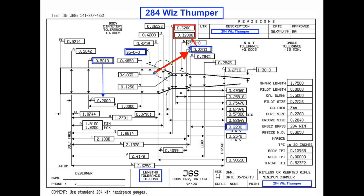Then we have the neck diameter. I'm only looking at this single number because I don't do any kind of tapered necks, as you heard Terry talk about. You'll see numbers here indicating different points across the neck. If the numbers change across those points, something's off. This is 320 to 320 to 320, which tells me this is a straight neck reamer cut. If for some reason it was 300, 290, or 350 or something weird, I'd want to know why I have an angle in my neck and that it's supposed to be there. With most common calibers — 6.5s, Creedmoors, 284s, Wisms — within normal disciplines like PRS or F-class, they're going to be a straight wall neck.